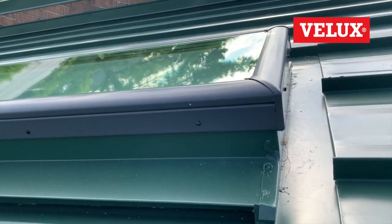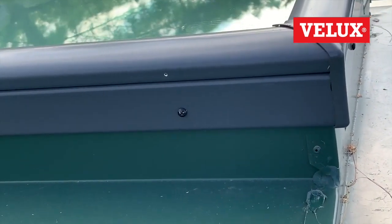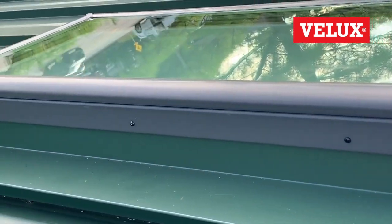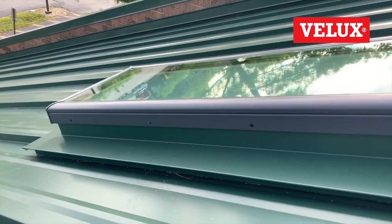So here we are on a roof. This is a metal roof today with 27 curb mount skylights here. The key to identifying curb mount skylights is where the screws are. A curb mount skylight is nothing more than — a good analogy or metaphor is a shoebox. The box is the curb or the frame of the skylight and the skylight itself is just the lid to the box, and the way that skylight attaches to the curb is by screwing through the side like this. You'll notice the screws right there, and these screws follow the entire perimeter of the window on all four sides.